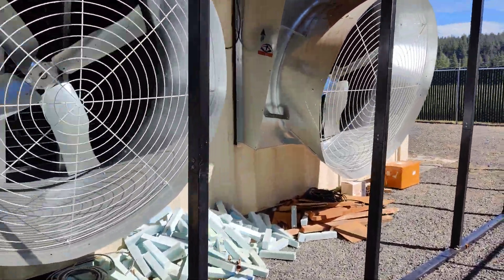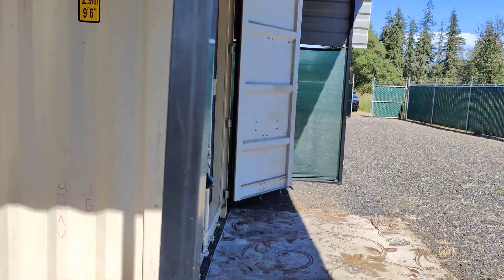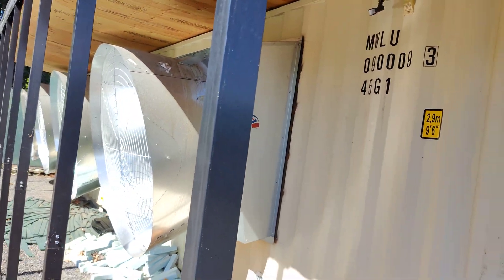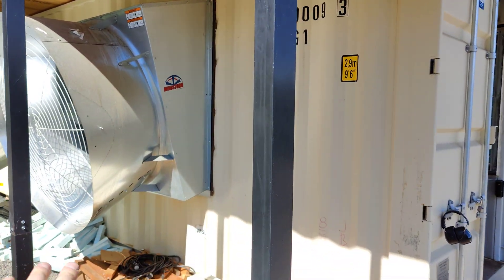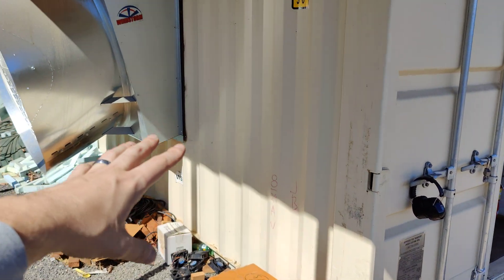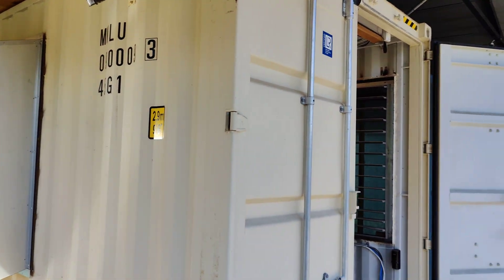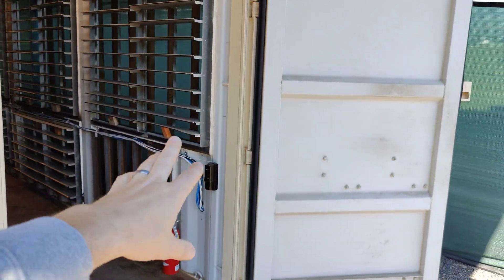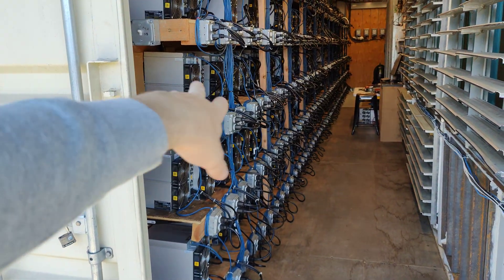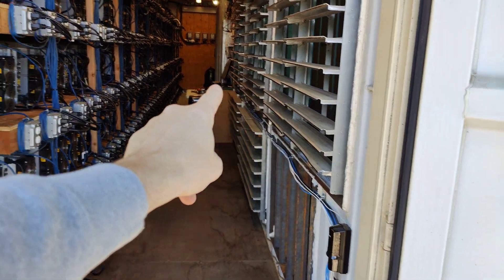Right now they are working at maximum speed. The reason we have this: in the wintertime it's fine because it's so cold outside that the metal connex cools off the inside air, and the miners receive much cooler intake air. So the exhaust coming off the miners themselves is cooler. Let's say 40 to 50 degrees comes in, hits the miner...